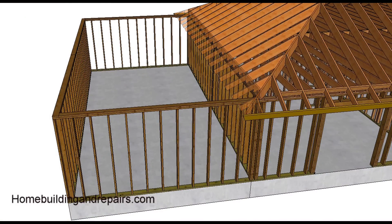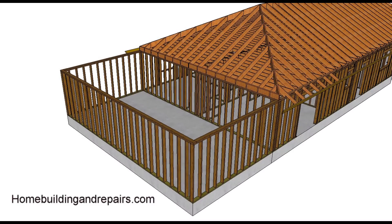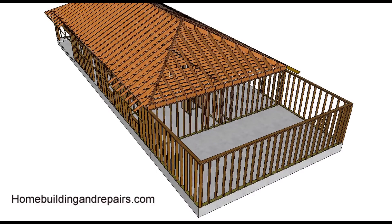Here's what it would look like with the blocks and the fascia board. Make sure that you leave as much of the fascia board as you can until you have the roof framed, to see if there's actually a rafter that's going to line up. You're actually just going to remove some of the sheathing to where you can install the blocks — you might need to snap a line across, cut the plywood, and then slip the blocks under and nail them in.